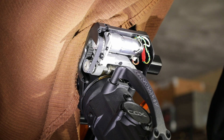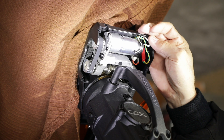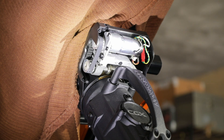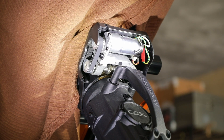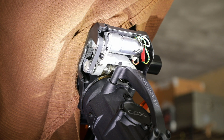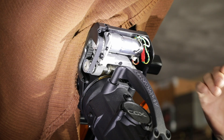The worm is the same though. The reason why you want to do this is that over time the backlash will loosen up. I have this thing slopped out pretty good — you can see it's moving quite a bit. I did this personally to show you how to fix it.